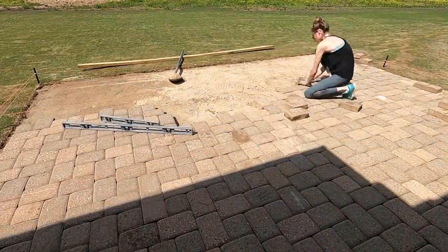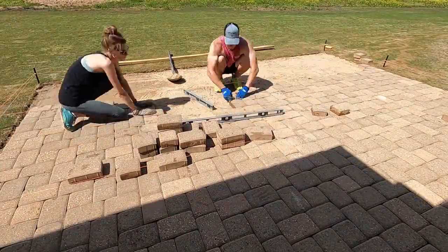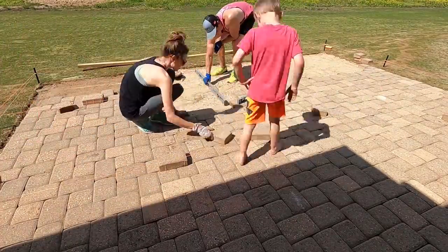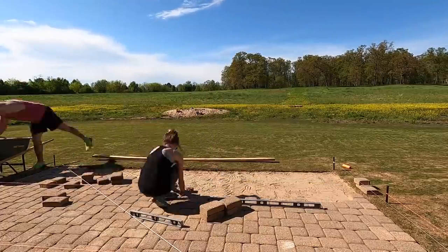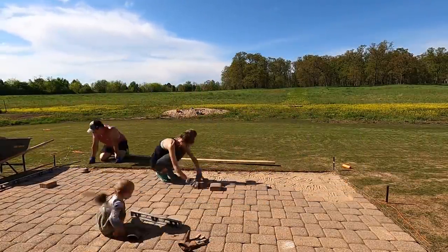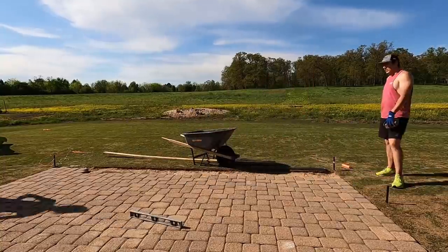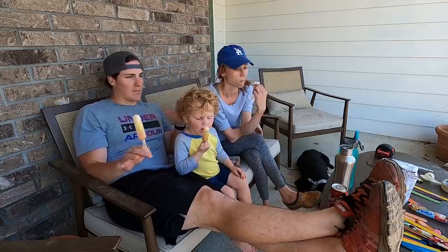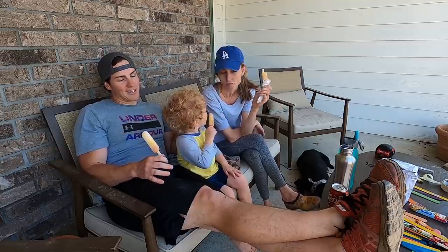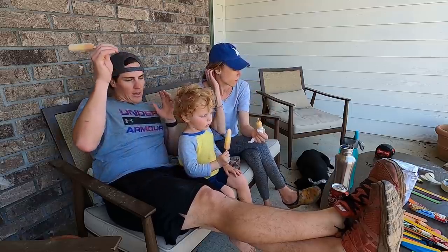Do like a pea gravel bed with the fire pit in the middle. We can put chairs out there all around the fire pit. It's also really soggy out there at least until I get dirt work done, so I'm going to move the fire pit out to that corner. Building a paver patio, what you're supposed to do is dig it out, put gravel — like driveway base or road base gravel — pack it down like crazy, water it, pack it down, water it, pack it down. We're not doing that.